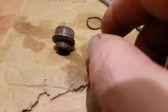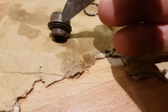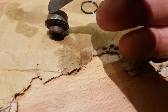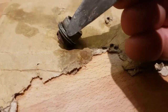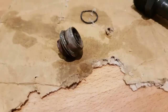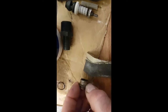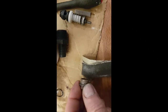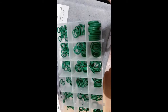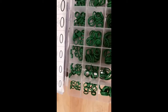I've took the seal off — it's damaged. As you can see, it's all got a bit of lime scaly stuff here. So I'm going along with an old knife and just scraping that back very gently — all round there. I need to get all that off before I put a new seal on. Just used wet and dry circumferentially, gone round that and cleaned it up. And I've got one of these kits, so there'll be a seal in there similar to it.